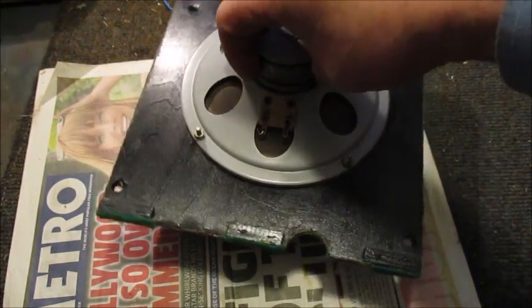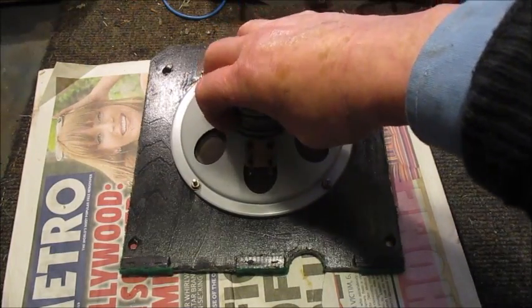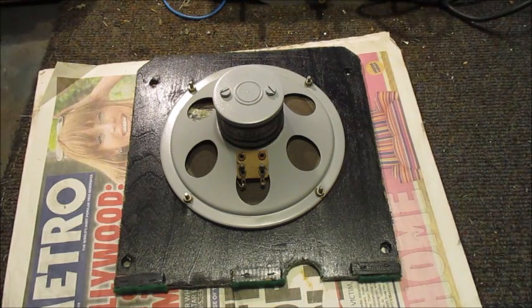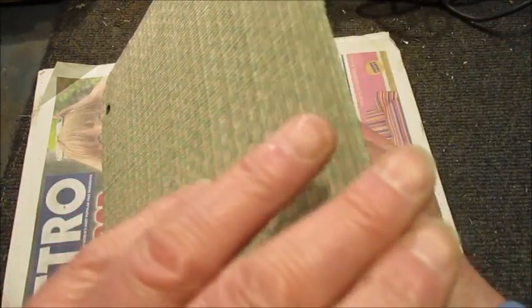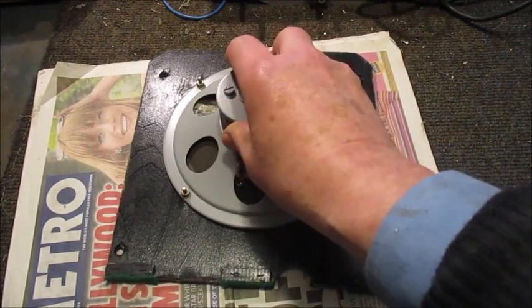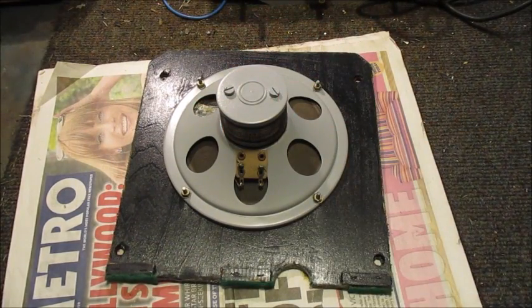My reason for doing that: this new speaker cloth easily frays. One reason why I use a hot soldering iron to make four holes in the speaker cloth. The cloth easily melts, therefore preventing fraying round each of the holes.